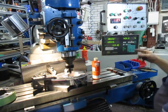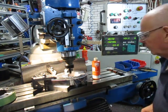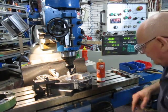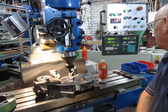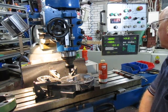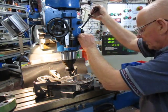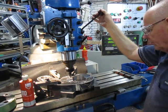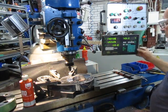We're not going to do number four because it falls in the trench, so we're going straight to number six. Number six is 98mm across that way. When I do the drilling I normally jump across so you only have to move one axis at a time, going from hole to hole — in this case I'll do it by hand. We're two thousandths of a millimeter, which is far more accurate than we really need, but that's the great thing about DROs — they give you extremely good accuracy, far in excess of what you sometimes need.